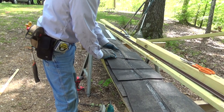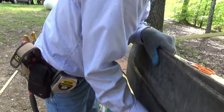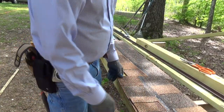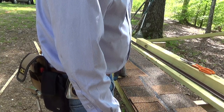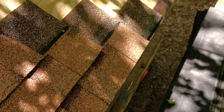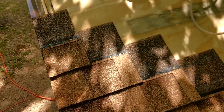Okay, so I have a set of enders here — or I can use them for starters if I want. And then on this end I have my set of starters. You start with one set, you finish with the other cut off, because you're going to cut them to fit on the building. Now we have our starters on. You can see my starter strip with the tar at the bottom, and then a full shingle, then step back for my first cut off, and the next, and the next, and the last. And that's called stair stepping.